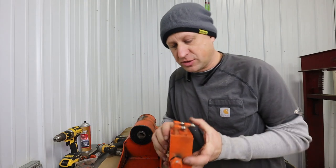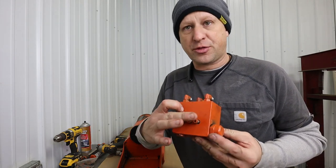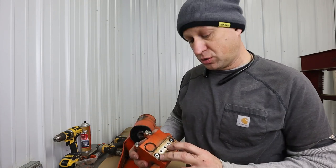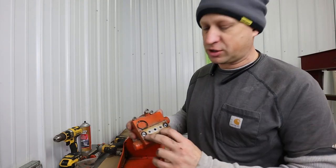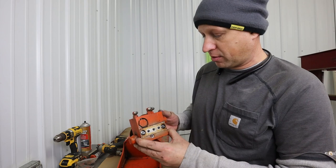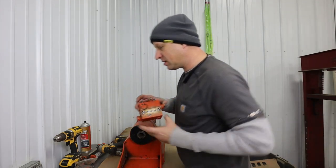Okay, so that safety valve is really just held on there with three socket head cap screws, not Allen bolts, there's no such thing, and is sealed to the working ports of the rotator just with a couple O-rings. So I'm not even gonna take that apart any further. That's just gonna stay like that. We've got new O-rings in the kit, so put that to the side.